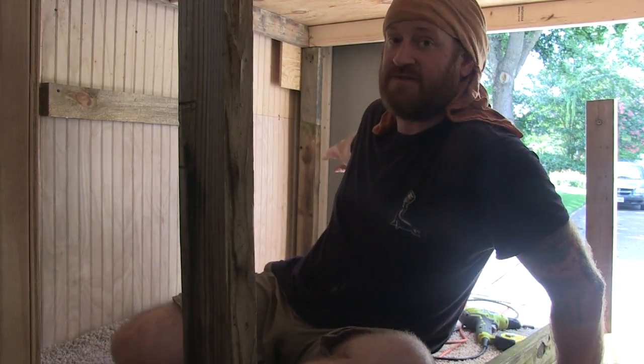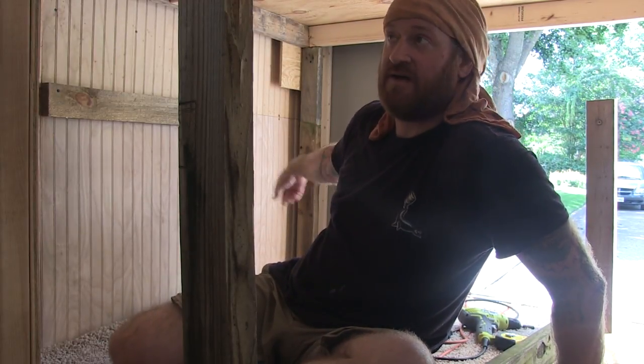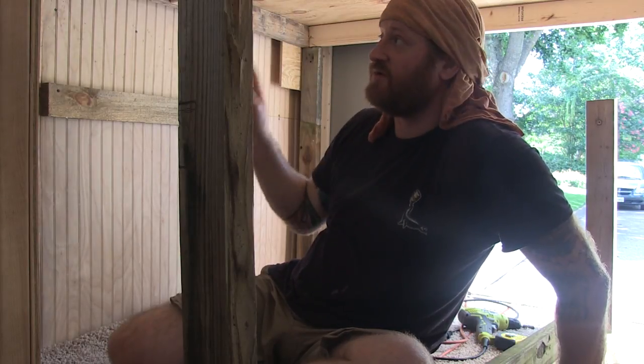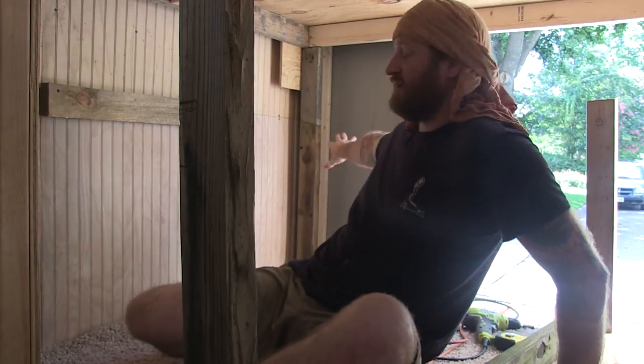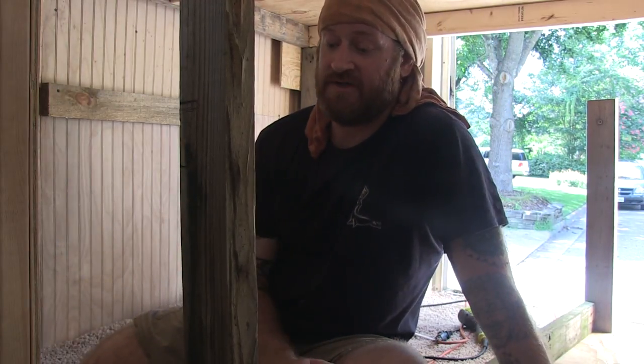And then I'm going to put one supporting 2x4 on either side, which will be the exact distance from this wall and this wall. This wall is actually 2 inches because it's got a 1/2 inch spacer to make sure the bed doesn't go over too far in any one direction. And I measured out this board, the whole back area is, like I said, 59 3/4 inches between this post behind the shower wall and this post in the very back, which is very opportune because 3 inches shy of 59 3/4 is 56 3/4, and I've got a trunk that's going to fit in the area where my legs are going to be.